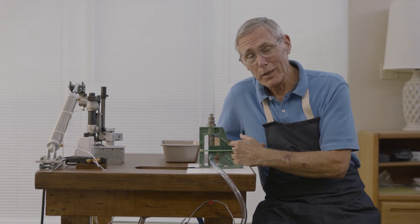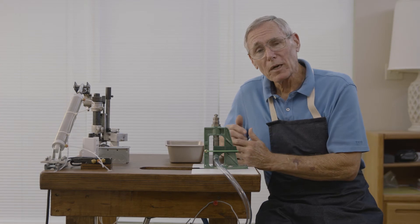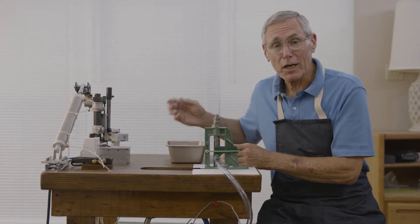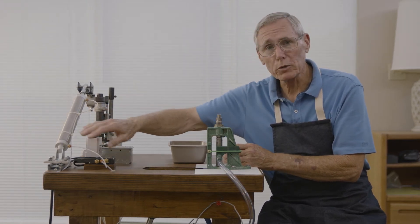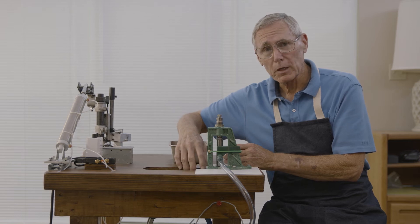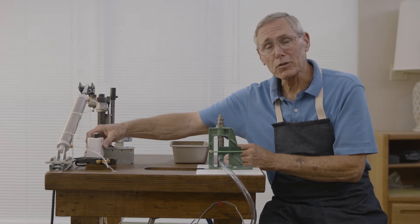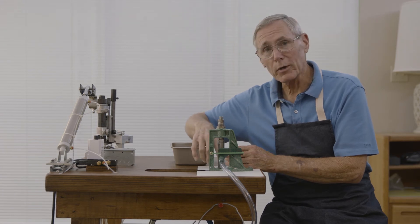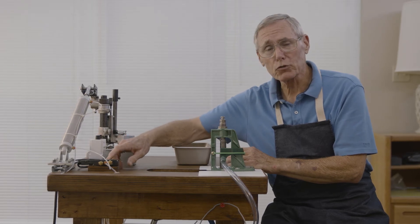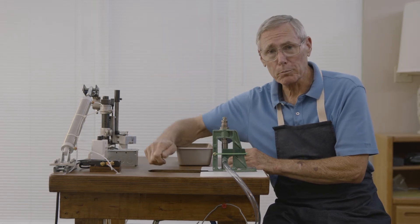You're probably looking at this and saying it looks nice but you're not sure how to get it all working. In my previous video on sizing bullets I used this same setup over here on the side — all the same components. You've got an on/off switch and a timer. All that timer does is control how long it dwells at one end and how long it stays at the other. And this is a solenoid — it controls the speed at which it goes up and down.